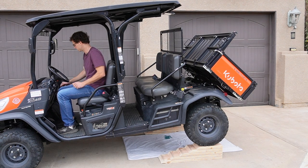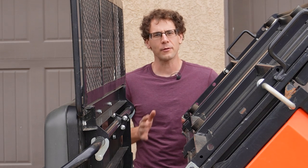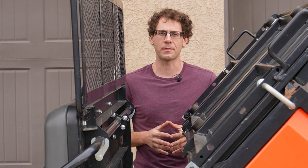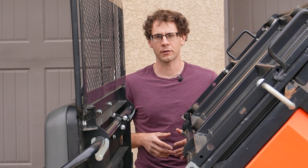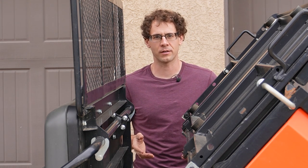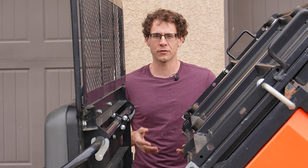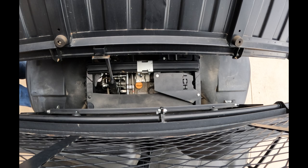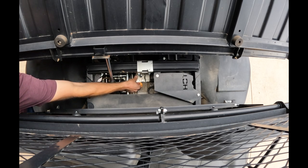Now it's time to service the transmission case. Remember, the oil in the transmission case is basically just gear oil. It's in there to lubricate the differential, the range gearing, the gearing for the four-wheel drive. There's really nothing special about it, and there's no filters associated with it. There's just a fill port with an integrated dipstick on top